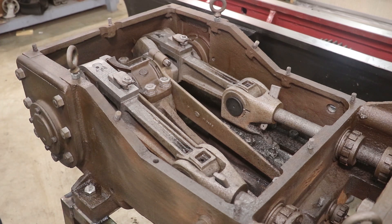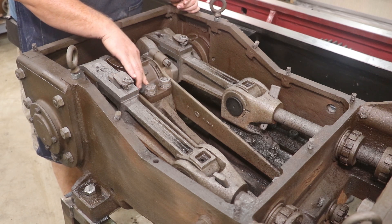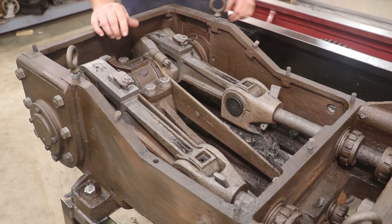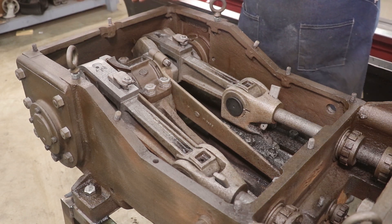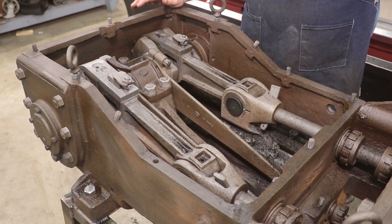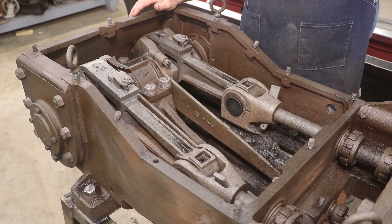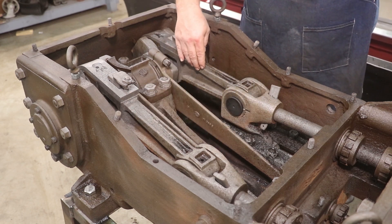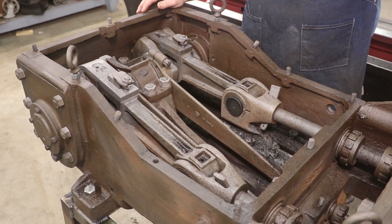Looking at the stuff that's pretty badly damaged in here — pretty much any of the steel parts like the nuts, studs, anything like that — there's lots of pitting, lots of erosion, lots of material gone. This nut down here hardly has anything left on the sides. So it looks like pretty much all of the steel parts in here are going to have to be replaced. But most of it's just hardware, so that shouldn't be an issue. I'm sure there's some stuff I'll have to remake once I get in here and start looking at it. Hopefully the castings will be in good shape, and they generally speaking are — not much pitting. They were pretty heavily rusted but in the grand scheme of things I think they're going to be salvageable.